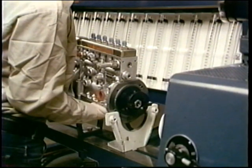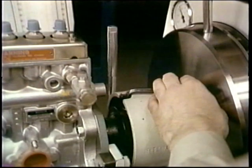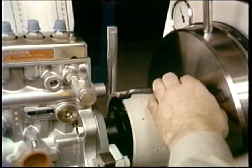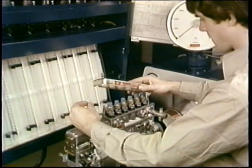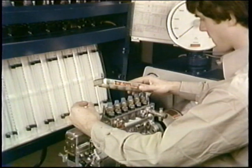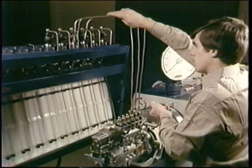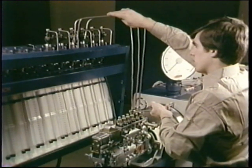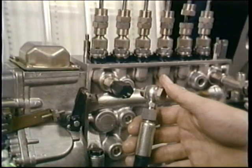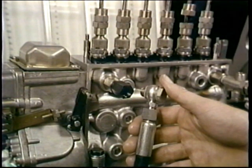How to mount the pump governor combination. How to align the coupling horizontally before you tighten the jaws. Begin by removing this cover unless it was left off in your reassembly. For this application, you're using engine nozzle holders, so you run these test lines right into the tray to start with. When you've connected the feed hose, using an adapter like this to match the threads of the pump housing, you've completed your preparation.